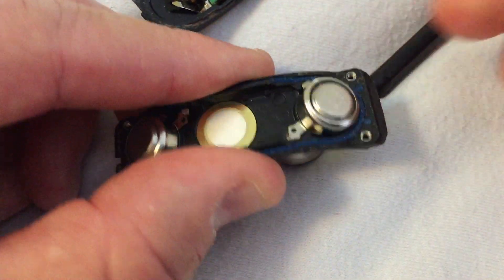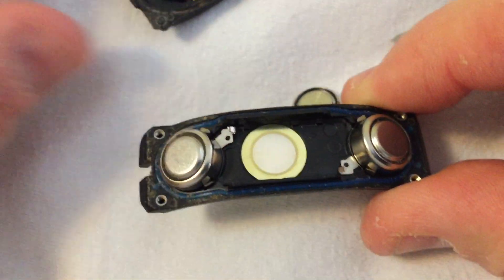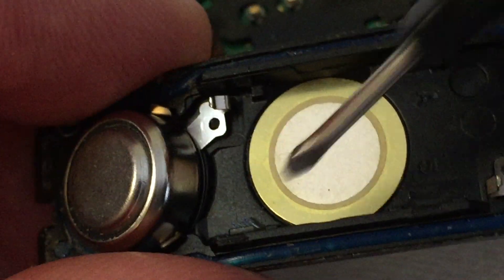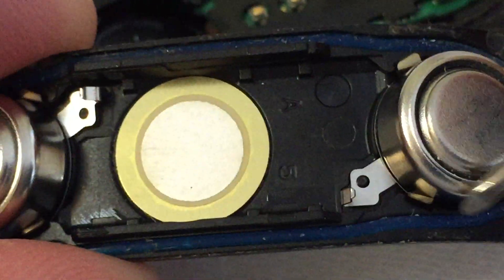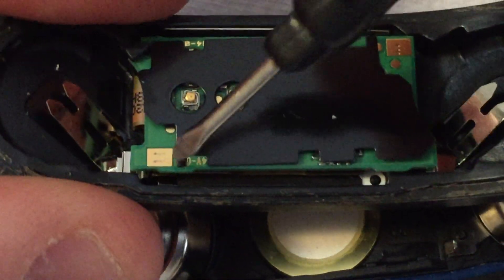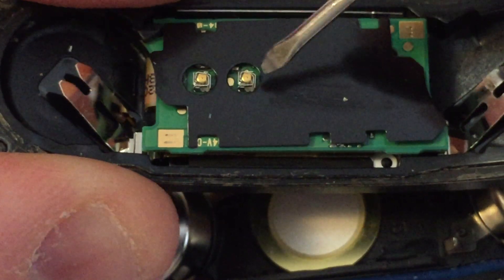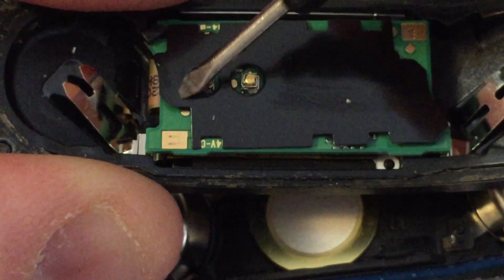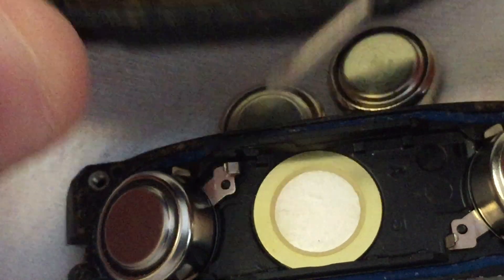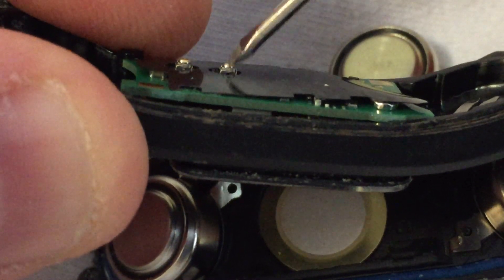So what you'll see in here — this is an LR44, there are two of them. They're way thicker than the substitute you're supposed to really put in there, and the reason why the case doesn't close and work is because there's a small pin here. This little contact right there, and this little contact right there, make contact with the back of the board here. The speaker also has to make contact with these two small pins. So you're going to lose your beeping functionality too with this modification, unless you thicken up or add a bit of solder to these elements. They only go up so far — there is some pressure there, you can see it has some give, but not enough.